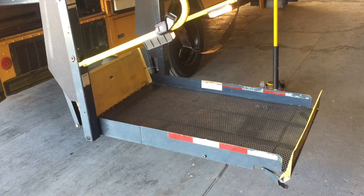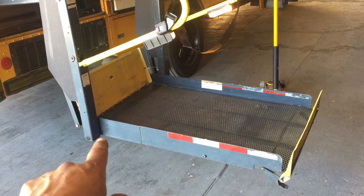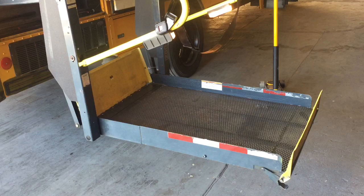For this one I'm going to put a jack stand on this side and jack that side up. I need to relieve the pressure off that cylinder, because if I remove the hose that thing is just going to drop and pinch my fingers as I'm working on it. So I have to keep it suspended — let me go ahead and get those two anchors on there so it won't move anymore.